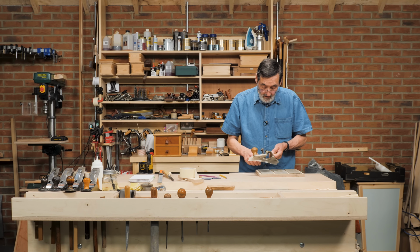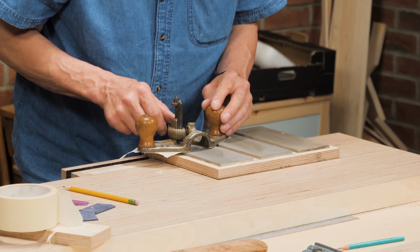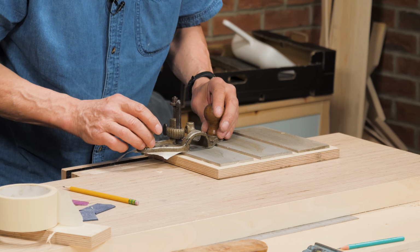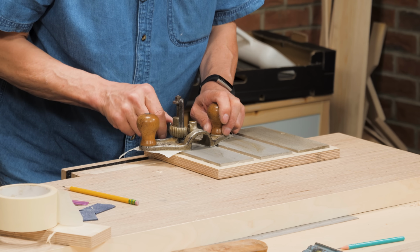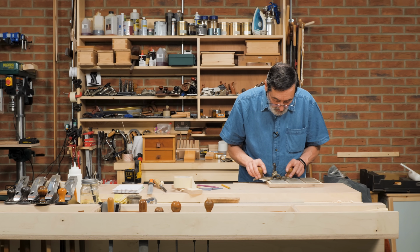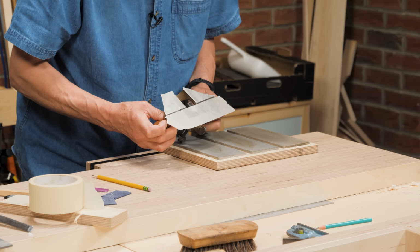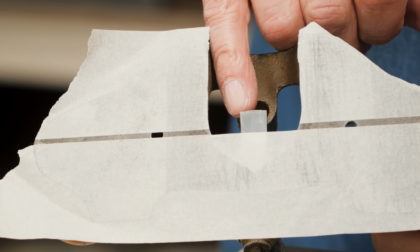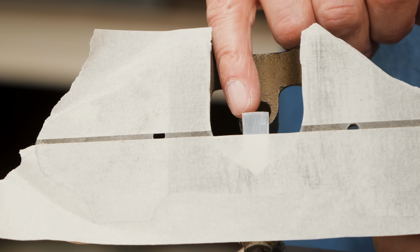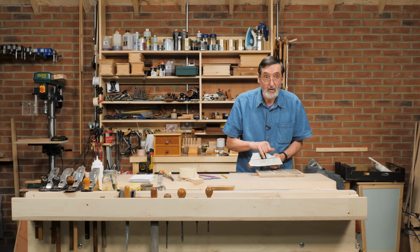So now I'm going to take just a little notch deeper, not much. It looks like I'm turning that wheel a lot, but I'm relying on the sole, so I don't want to take too much. I'm going to back off there because it was rocking too much. So what I've got now, I've hit the corner. I'm right on the corner. This side is much broader than I want it to be. So I now balance this out between the underside of the blade and the top side.